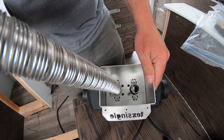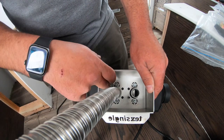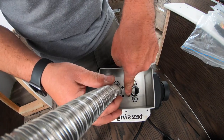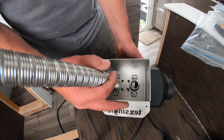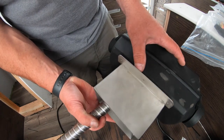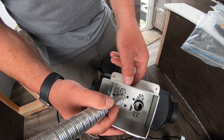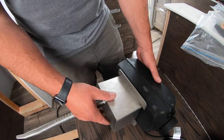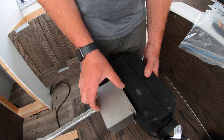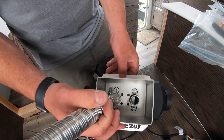So this is the view from the bottom. You can see I've got the exhaust pipe attached, which just uses a standard hose clamp, and then this is our fuel line, and over here is our air intake. This cage around this thing, which measures about three and a half inches, is for passing through a floor that's pretty thick — it's an accessory I bought in addition to the heater. If you're going to floor mount this, this little backer plate I would highly recommend, because you get all this width to pass through without any heat transfer into your floor, especially if you're running a combustible floor.